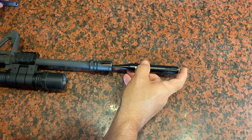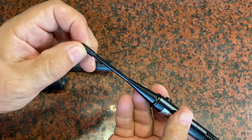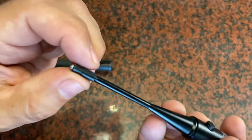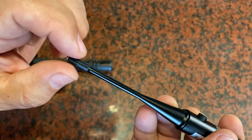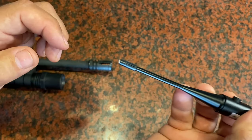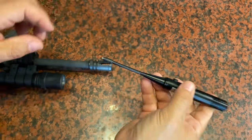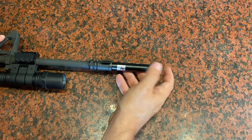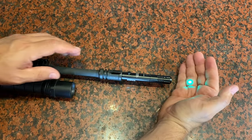This is going to insert into the bore like this — it's very snug. If you notice you can't get it in, you'll need to loosen this a little bit to allow it to compress back down, because there's a little taper here. As you tighten it, it'll flare out. So if it was loose, tighten it a bit to flare out and make a snug fit. If it's a little too tight, back it off and it should go in just perfect. We've got the button right here, shooting out our laser, and we'll take aim with our scope onto a target.